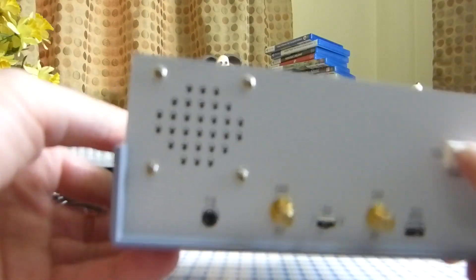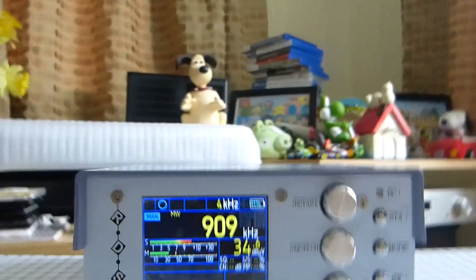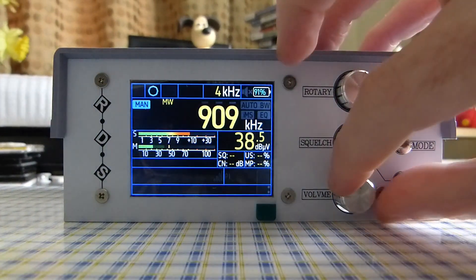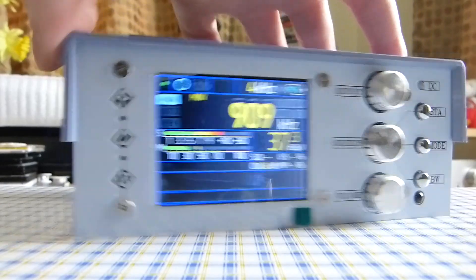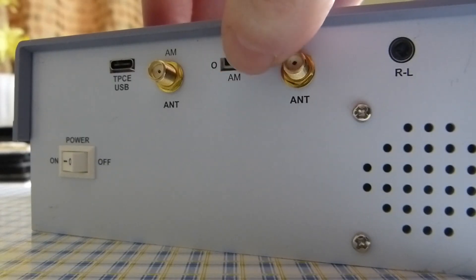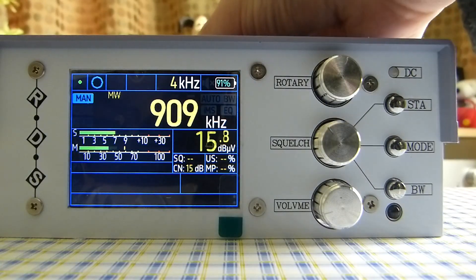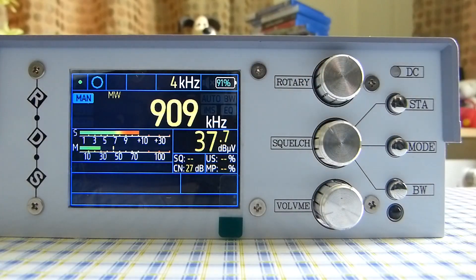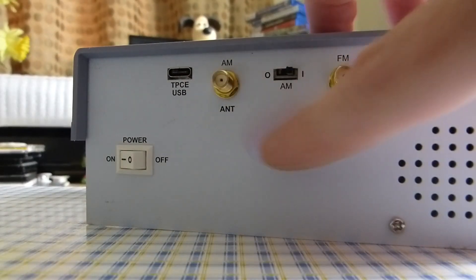Let me switch this on very quickly. Be careful when you open this — things can fall out. Right now it's receiving the station with the built-in antenna — it's in the one switch position. Then I turn it off and it gets worse. So maybe it's getting the reception from the SMA connection. Let me turn it back on — as you can see the signal strength has gone up. So it is using the built-in AM antenna. I'm just very disappointed that this radio doesn't actually come with a built-in AM antenna; it could be that it's just depending on the SMA connection.